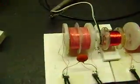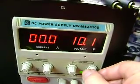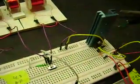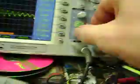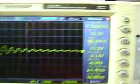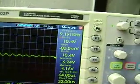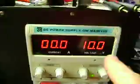Alright, we're going to switch back to this coil and go to 10 volts. We're getting some popping noise from the stereo. So we're on the regular coil, got that one pop out of the stereo. We're at 10 volts, so now we need to change our scale. Okay, this is the regular coil with the capacitor, 10.2 volts peak to peak. And the frequency is changing, going lower as we increase the voltage. This is the only thing I'm changing, this and the switch and my thumbnail.